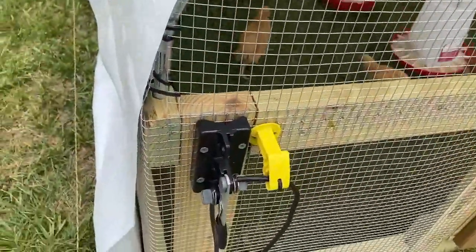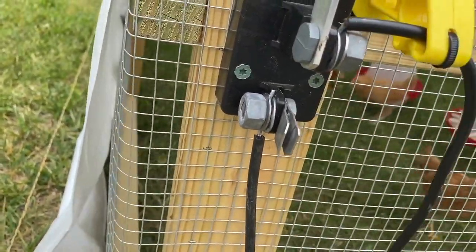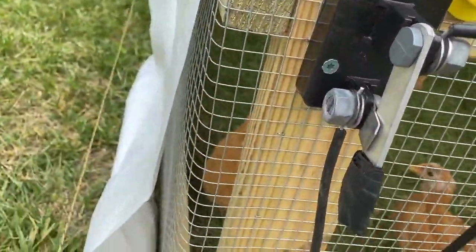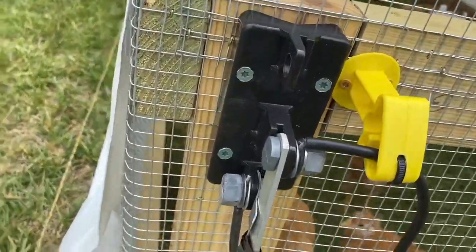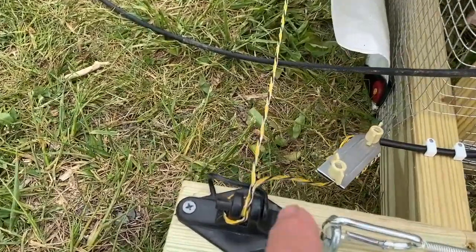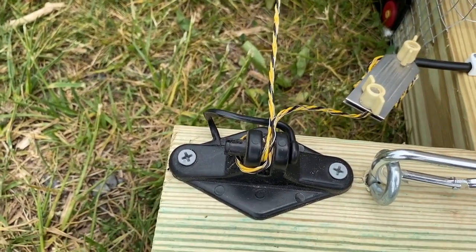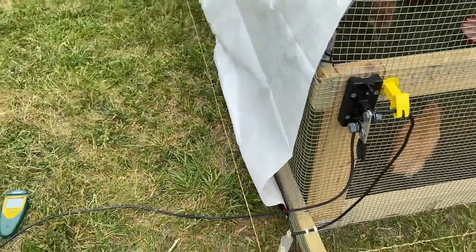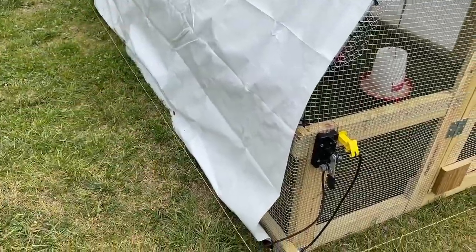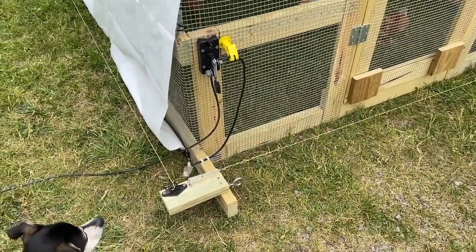The red peg is hot, and the hot comes over and connects up to a switch right here — connected up to the bottom side. The switch allows the circuit to be open or closed: right now it is on and the system is energized. When it is closed and connected up, we have electric coming down this wire, changing over to the string right here. The string has little wires through it, and those wires are what will electrify anything that touches it — intended for predators. We are six inches out, six inches off the ground all the way around to deter any predator from getting into the tractor.